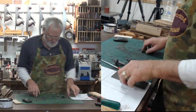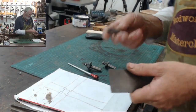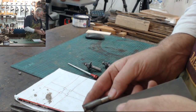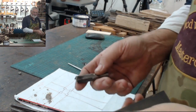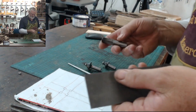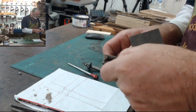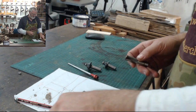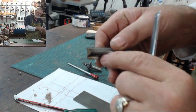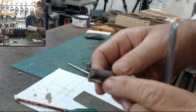So all you do is go there. It's the inside edge you want to clean. You can see all that. Got a bit of a build-up of gunk there. The Easy Lap diamond files I use are anywhere from $21 to $40. I generally use the purple one, which I think is medium, and it's got a really sharp edge on it. With the sharp edge, you just run that up there and you take all that white muck there. That's just a build-up of resin and gunk.